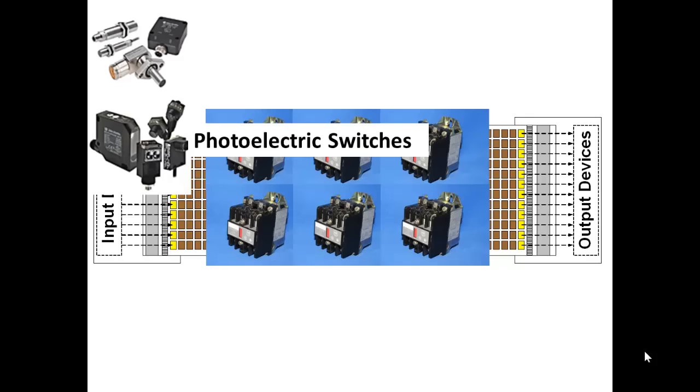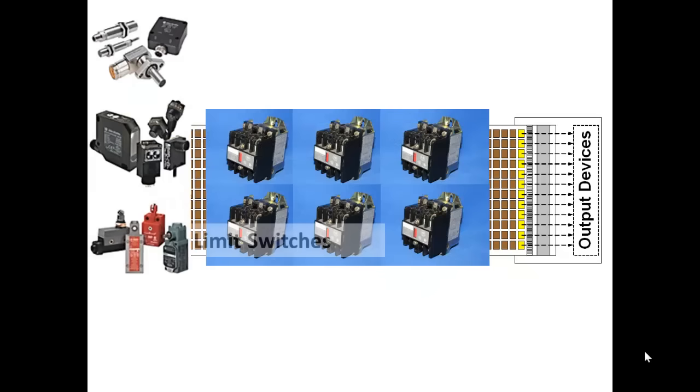Besides proximity switches and photoeyes, we also have limit switches. They're one of the oldest presence sensing devices, sensing presence by actual contact with an actuator on top of the device that operates a switch. Two of those, you can see a plunger with a little wheel. The other two would require an additional item that you purchase called an actuating arm that's adjustable both in length and angle.